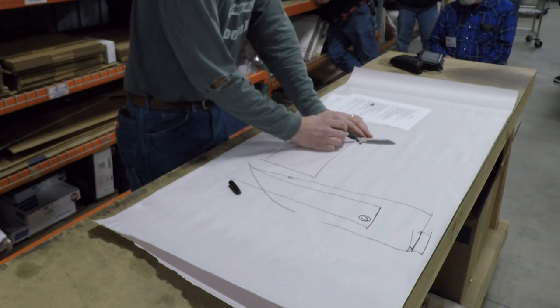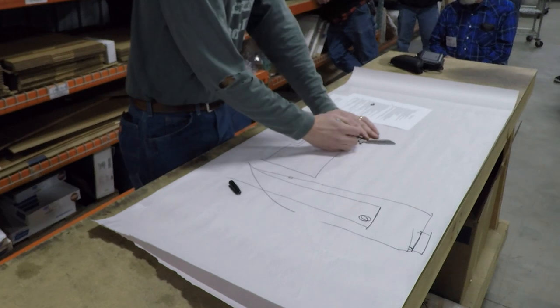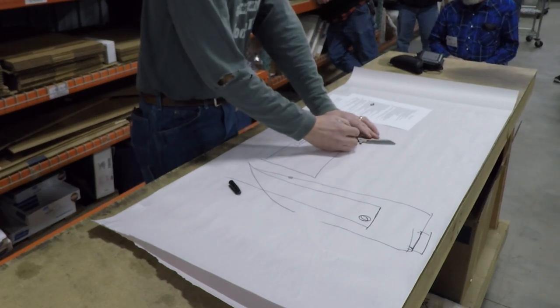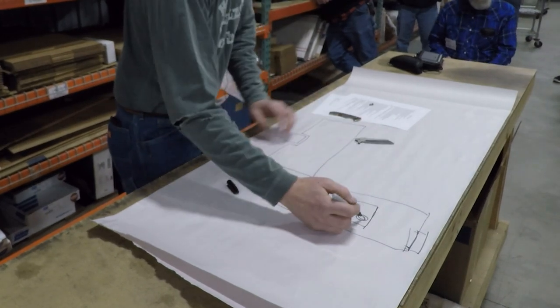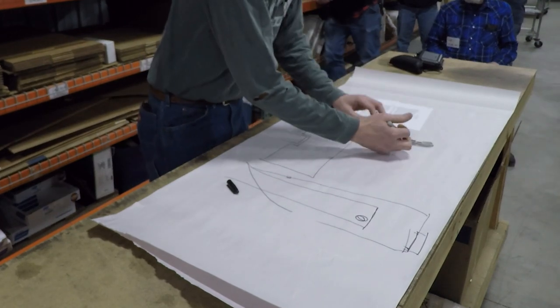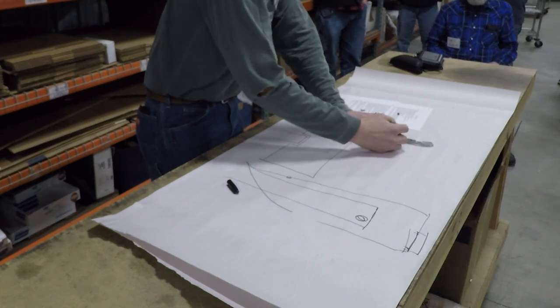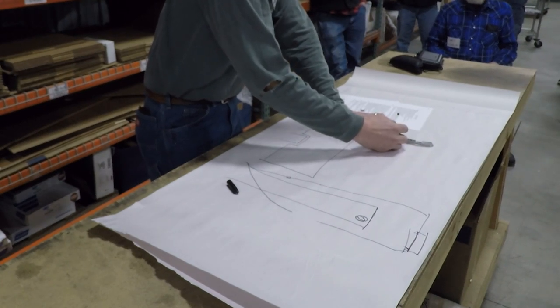set this at around 1 to 3 degrees offset. So you want to grind everything on the top. What you're basically doing is making a triangle: there's a point here, and then a point here. You've got your detent, your pivot, and then your lock up.